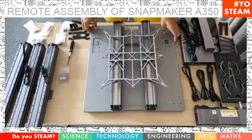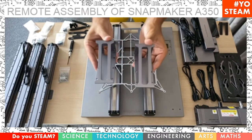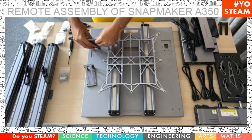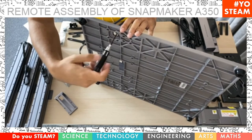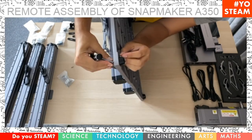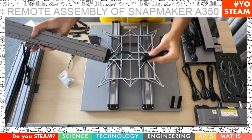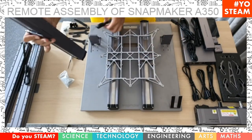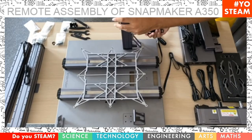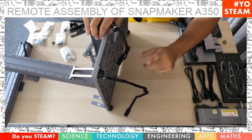Turn around and look at the Y axis linear modules, making sure they are accurately mounted onto the grooves of the base plate. Now tighten the screws from the sliders in the Y axis — it's a little complicated because you do it from the bottom, but you can move it until it matches and see the screws through the little holes. Next step: the Z axis holders. You have two of them, place them at the back of the base plate and screw them all the way. Then also attach the touch screen holder from the bottom.